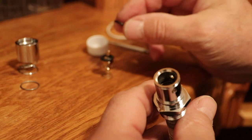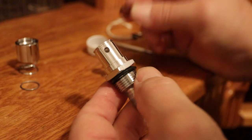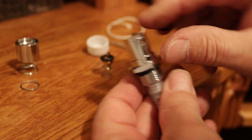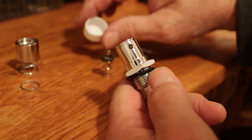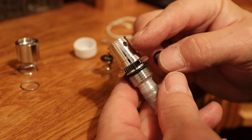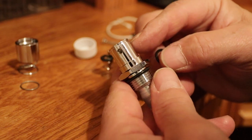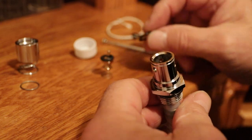This O-ring is around the top and sits just under these ball bearings. You better watch these ball bearings — if they fall out, which mine did, they're right there and would be hard to find. So make sure you put a piece of tape or something around those, or take them out — whatever you want.